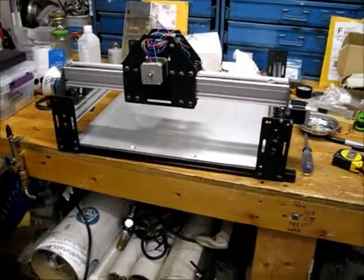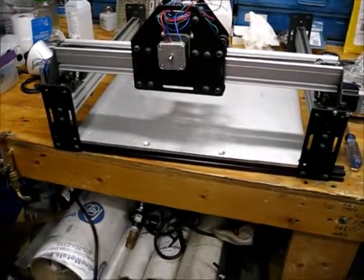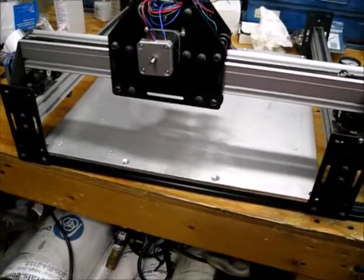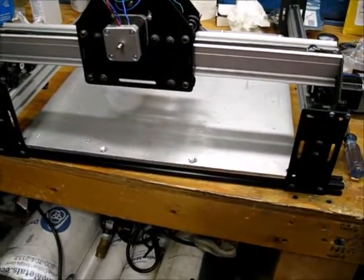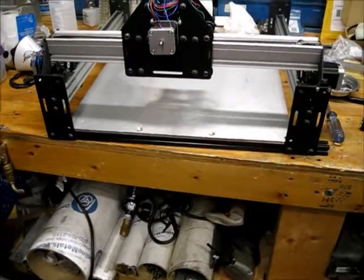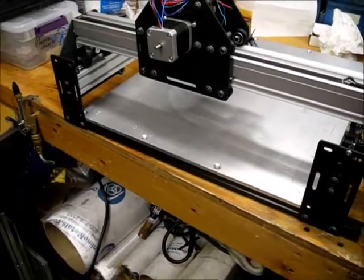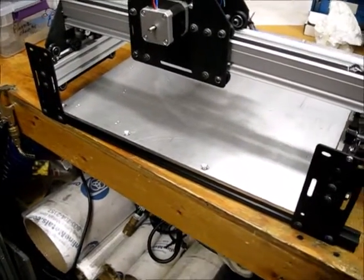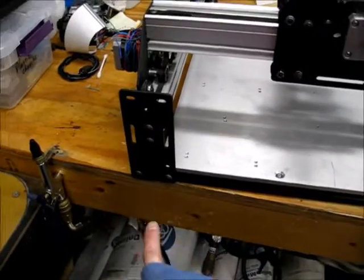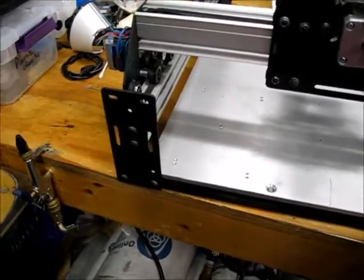Here are some quick notes on squaring up the plate once you get it together. Step one: loosen all the bolts and T-nuts along the plate and the bottom two bolts on each of the upright plates. Make sure everything else in the gantry is tight and square to each other, because as these plates and rollers move it changes how the gantry rolls on the tracks. To start, I picked a random corner and fully tightened those two bolts once I flushed it up with the end of the extrusion.